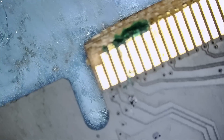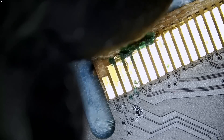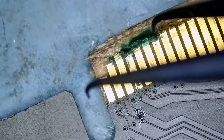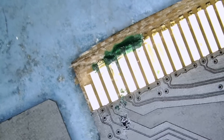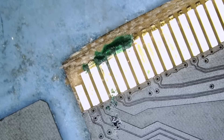I did not see the pins down at the bottom until I finished replacing that connector first, and maybe that's a good thing — because if I saw those pins maybe I would not have fixed the melted connector. What I want to do is check on the UV solder mask that we added. Wow, we did awesome — I never tried this before but it worked amazingly. All I had to do was add UV mask on the bottom pins and that solved the problem. Even if I had added glue under each pad, if the tip isn't secured like this it would end up folding backwards. I'm glad that worked. We can add a bit more here so the customer does not have any issues, and we'll let the customer know to be extra careful.